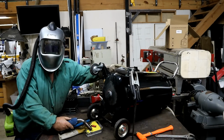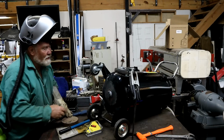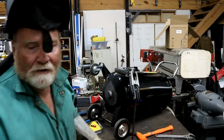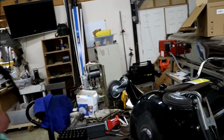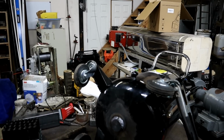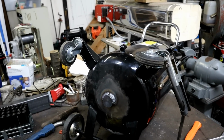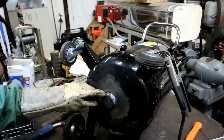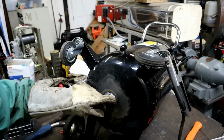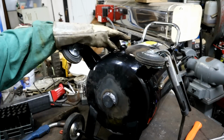You see all the gas come? That looks terrible welding, but it's going to hold. Looks terrible on this weld, but I've been trying to come over and keep all my heat on this side and then lay over passes. This has got 2, this has got 3. You can see the carbon dioxide coming out of the top up here. See it?